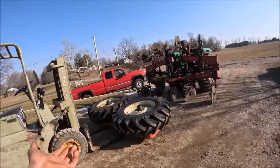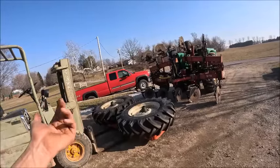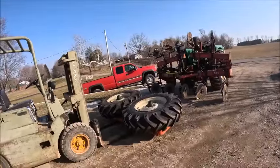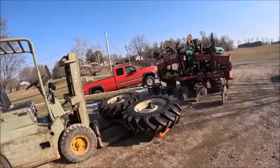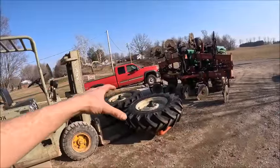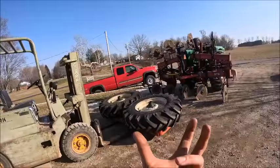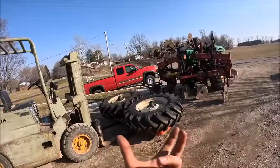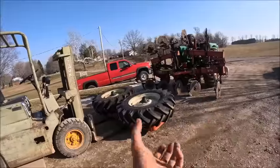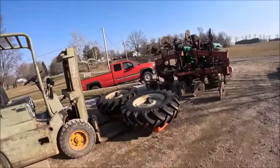Not that anything would ever happen to it, but you never know. Basically, it makes the spindle serviceable, so if something bad happens, you can replace it. Everything's going to line up right, and that's going to be welded right to the bottom of the H-beam. The only thing the end plate and the backing plate are doing is keeping it from rocking back and forth, so it doesn't have to be overly stout. So 1/4 inch plate's going to be plenty.